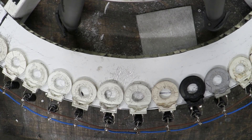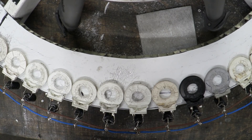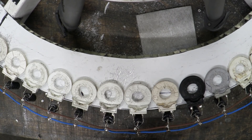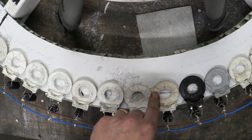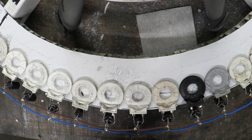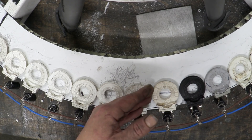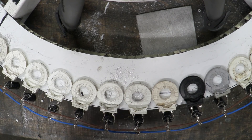I actually really liked it as an idea and it seems to be working quite well. This thing generates at very low speeds. It generates high voltage deliberately to overcome the resistances of all of this, because these wires are very thin and have high resistance, but with the high voltage it can overcome that and actually push some energy out. We don't have metal cores because we don't want the resistance between the metal core and the magnet to slow things down in the light breezes this is going to be operating in.